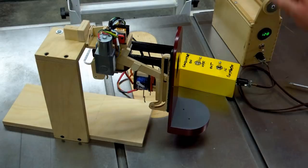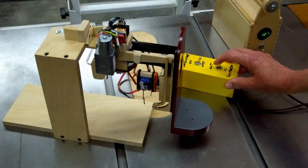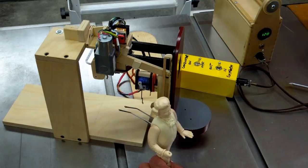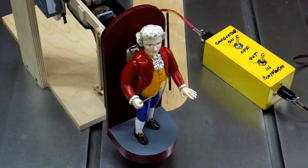I can turn the servos on or off. This is what animates the conductor. I can power it out, power it in, or stop it anywhere in between. I have the unpainted version here with all the control linkages. Since I have more than one, I will now replace this guy with this guy, adjust the linkages, and it will be ready to install in the organ prior to running hoses to all the pipes.